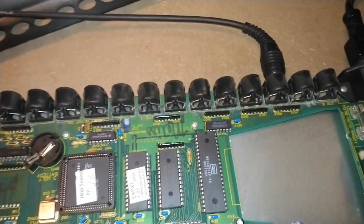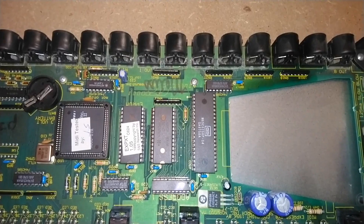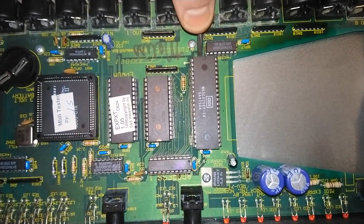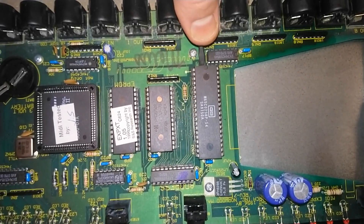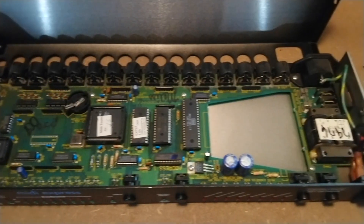I realized this was not an electrical problem — it is the computer behaving strangely. I tried re-socketing all the chips but that didn't help, so I kind of ran out of ideas. However, I noticed something you might already have seen: there's no battery in the battery holder.